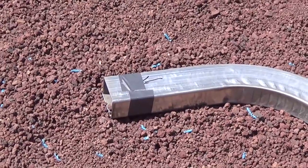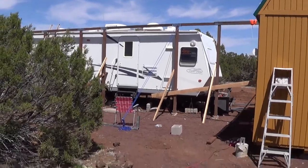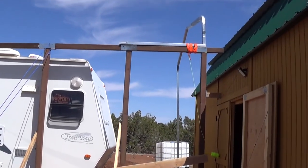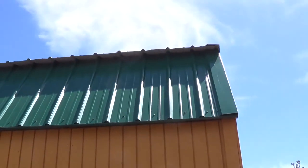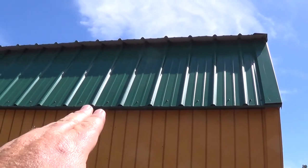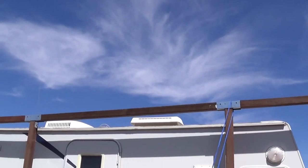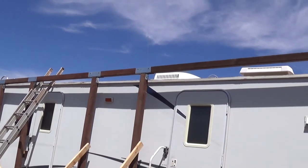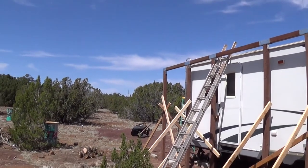Like I said, I am no carpenter, no architectural genius, no engineer — but this looks awesome. If you notice there's a slope — the reason we have a slope is because water has to run somewhere. The roofing panels, which just so happen to be the exact same panels and color as what's on this barn, flow with ridges going this way on the carport. That slope makes sure all the rain and snowmelt run off to that end, where I'll catch all that rainwater.